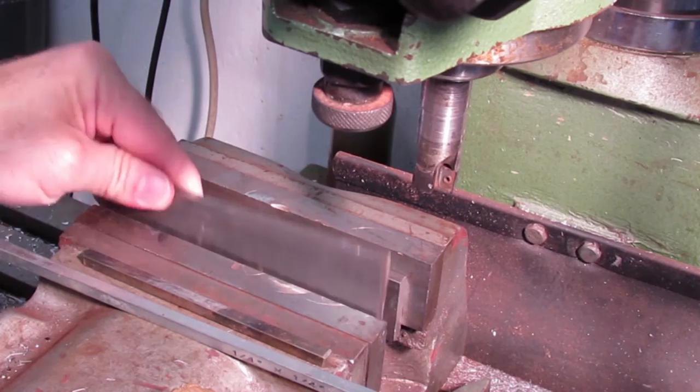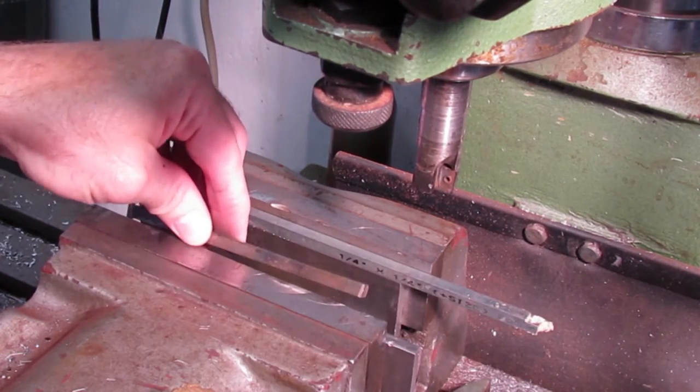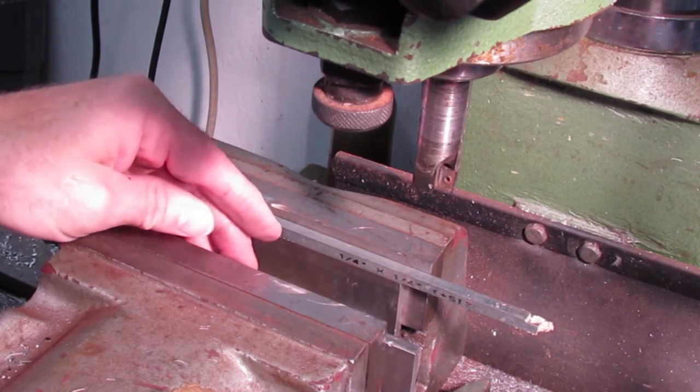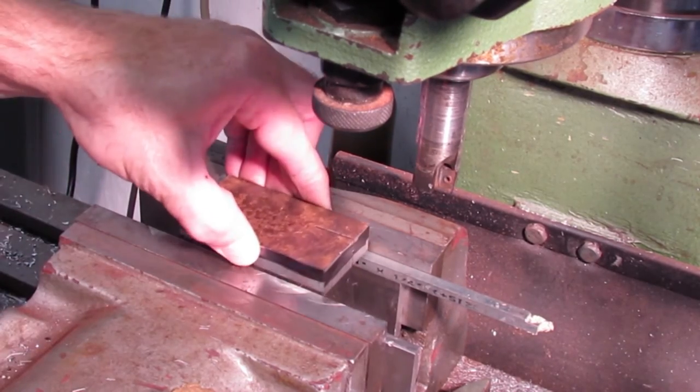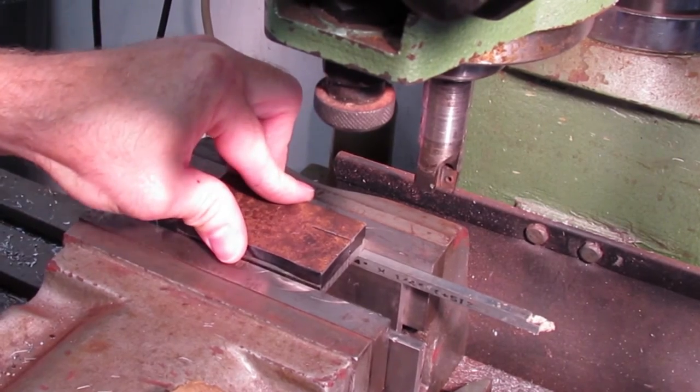Currently, the tooling I have in my garage is limited. Over the years, I never needed to purchase my own parallel set as my employer always had them available. In order to raise the steel blocks to allow for milling the thickness, I add a 1/4 inch keystock to the parallels to make up the difference.